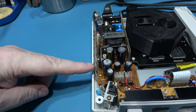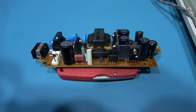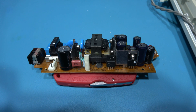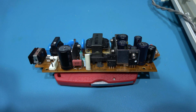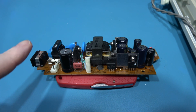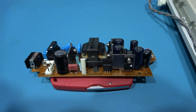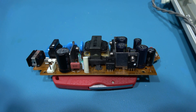I'm going to show you the reason why I do it this way and not remove the actual power transistor. So I'm going to reverse this mod and show you what happens when you remove the power transistor. Now, straight off the bat, I need to warn you: if you've never worked on a power supply before and you're not comfortable working on one, don't even bother — get someone else to do it, because you don't want to have an accident. Also, you need to be very careful with certain power supplies. You can run into something called dielectric absorption, where the capacitor — the main filter cap and some others — actually charges back up when not even powered on, so you can still get a good whack from one. Most power supplies will have a bleed resistor to discharge that, but on some they're not there, so you need to be aware of dielectric absorption.